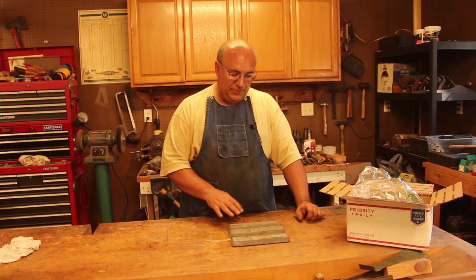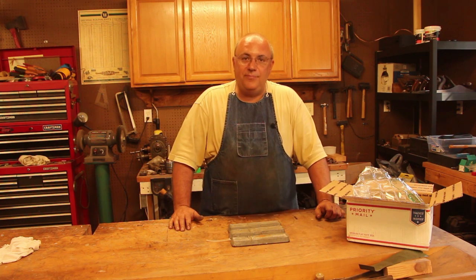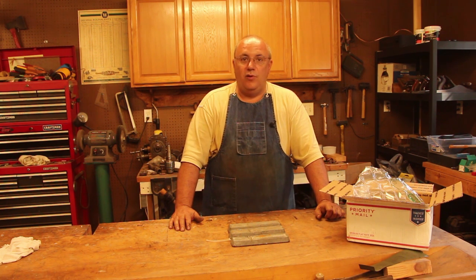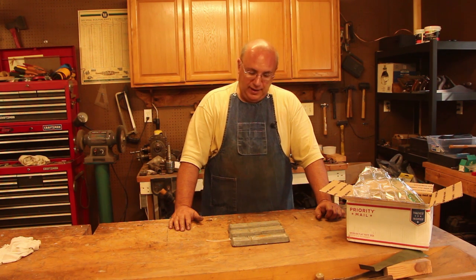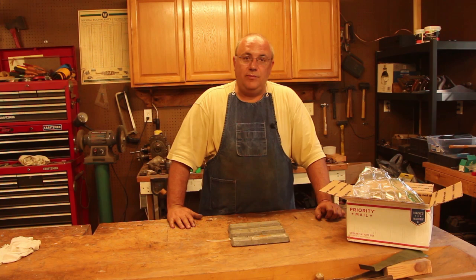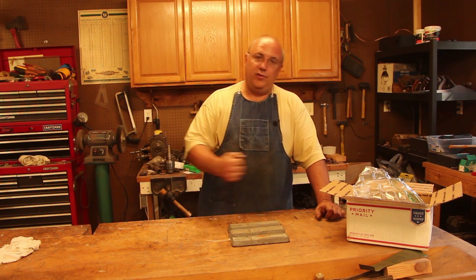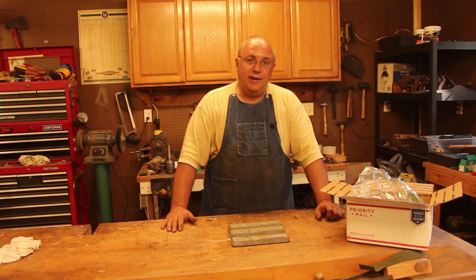and this is good Babbitt for all kinds of different uses. And I told Ken that his timing was impeccable because we've got several jobs at the museum that we're going to be pouring Babbitt for in the next, as I get to it. So on the Vance Planer Matcher, we've still got, let's see, 5 more bearings to pour, I think. And on the sawmill, I've actually got to do a job on the steam-powered sawmill at the museum. There's a clutch mechanism on there that drives the carriage, and it needs to be rebuilt. It's got some issues. It works right now, but it's got some issues, and that's going to be a priority job probably this coming week and next weekend.